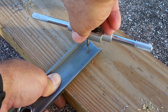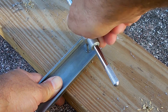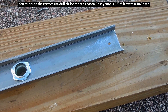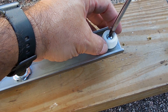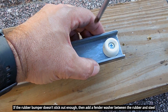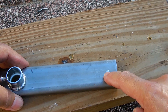Apply some oil to the tap, thread it in, and every so often back out the tap to clear away metal chips, then go forward again until you're all the way through. Right here we have a very nicely tapped hole. Take the file to both sides to clear away any chips. Now take the rubber bumper with the screw inside of it and thread it directly into the base. On the top side after it's secured, only a very small amount of the machine screw is sticking up.